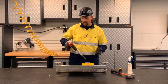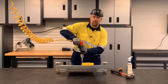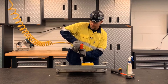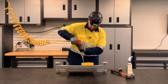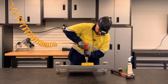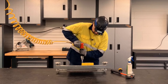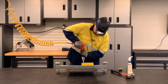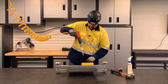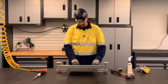When actuating the trigger on this tool, we want to make sure we're down completely against that rivet and holding force while pushing down and actuating the trigger, and then not pressing the trigger and releasing up. There you can see the rivets have driven fully and we got good pucker.